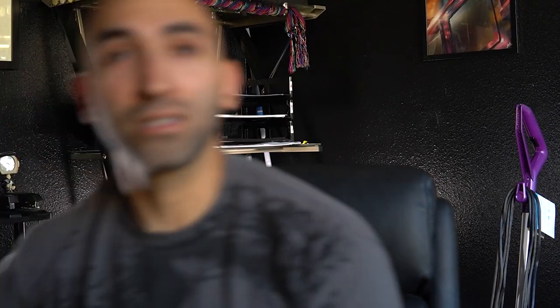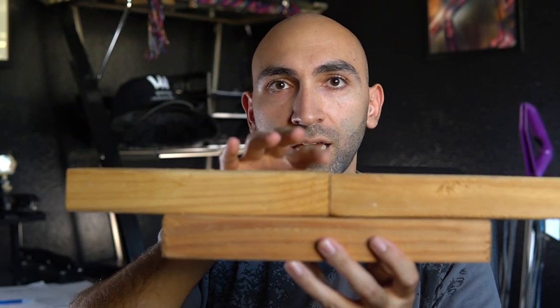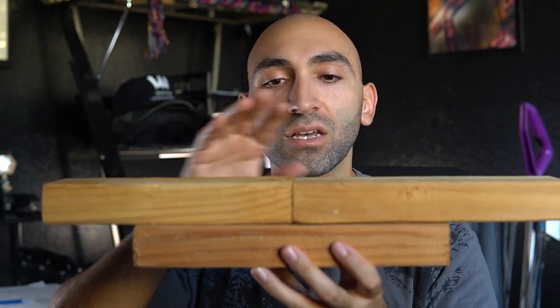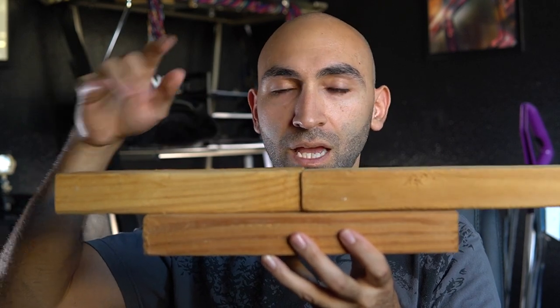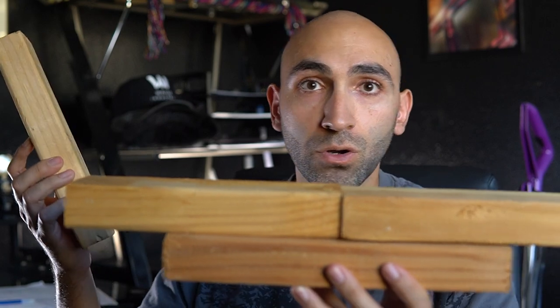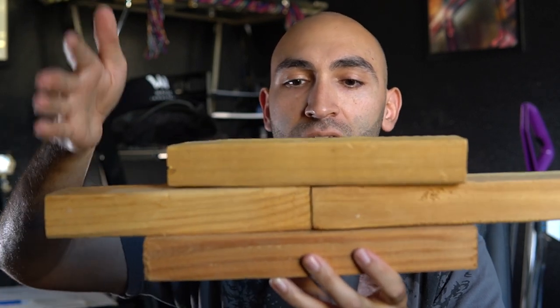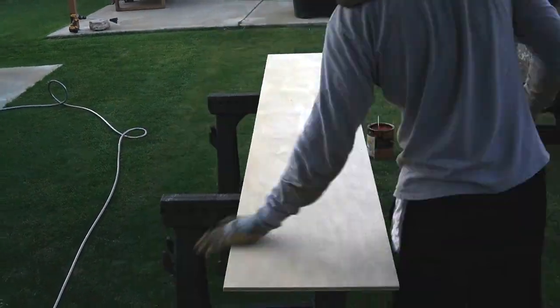To explain: the bottom part is the post, and where two pieces of wood join in the center, that joint only has some screws going down, so there's not a lot of strength holding them in place — the slightest force and the wood already lifts up. However, if you put a piece of wood over the seam and stagger the joints, it's a lot stronger and can withstand a lot more pressure and forces. That's why I added those extra two-by-fours at the top frame of my fence.